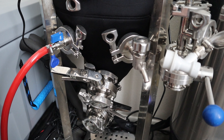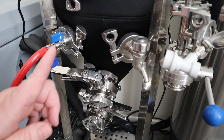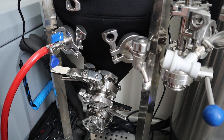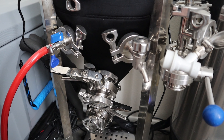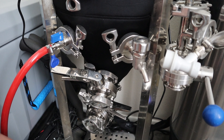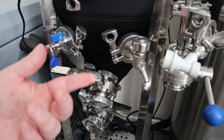So I'm going to quit ranting and bagging on them. We're going to spin this right now with the valve in this orientation. There's a racking cane inside of the tank that's pointing straight down — that was to avoid getting a bunch of yeast and trub and garbage inside of it. So I'm going to loosen this tri-clamp, which seems a little janky, and spin it ever so gently. Hopefully there's enough clearance. I really wish this stuff was a little further up.